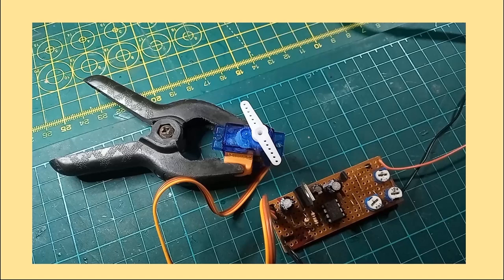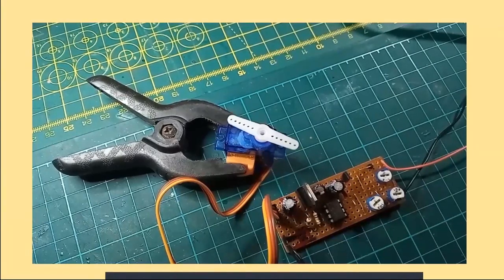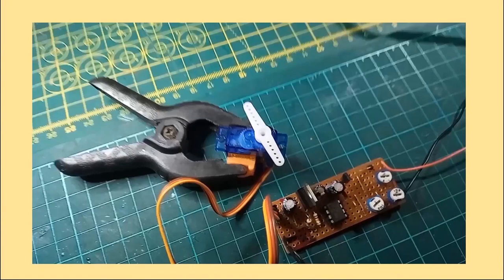Here we have a standard Ezy Points kit connected to a servo motor. Watch what happens to the servo horn when the power is applied. You will have seen an unwanted kick of the servo horn on power-up. If this had been attached to the jib of a crane, the results would have been quite disastrous.